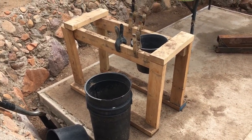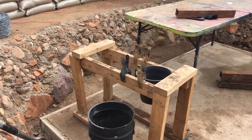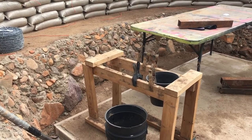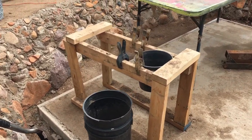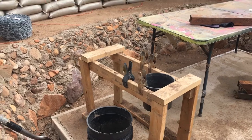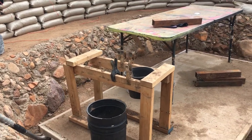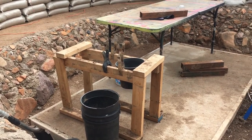This is how we started — well, actually this isn't how we started. We started doing it the hard way where I had a tomato cage and bent it around to try to fit the bags, but the bags kept getting snagged on it, kept breaking and snapping back. So I decided to make something like this — just took some wood and made a frame, just tall enough for the earth bags to fit in but not too tall so they're not hanging. It's real easy to put together. This is by far the fastest way I've seen to do it. You can buy things online but they're like 80 to 90 bucks or even more for these filling stations, and honestly you don't really need to do that.